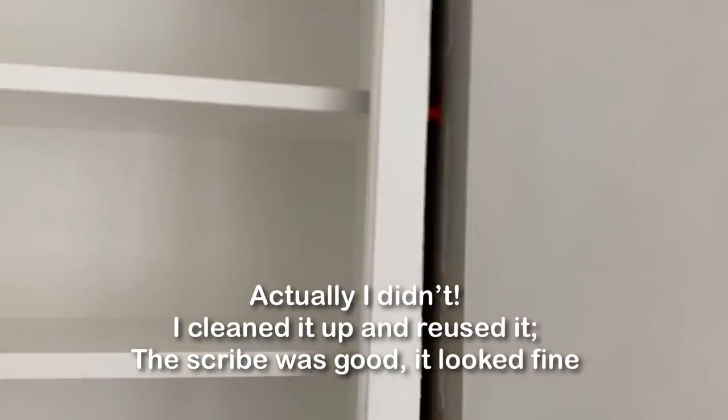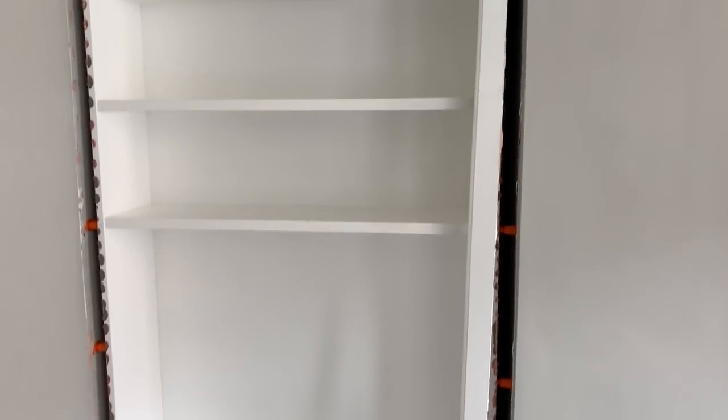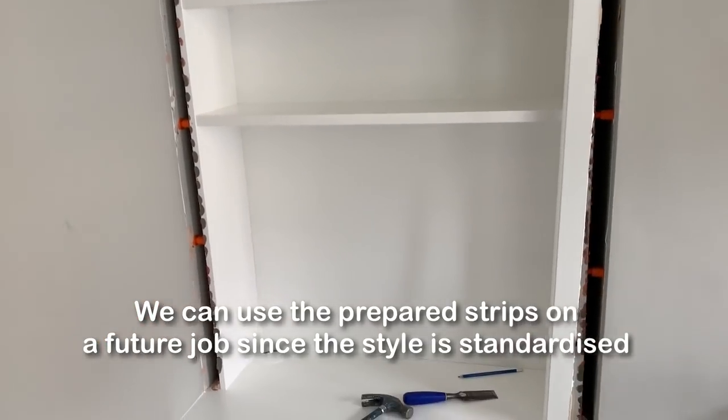Let it dry, two-part filled it, over-painted it. So if you looked really closely you could see the brush-painted join but with it being in shadow there it never jumped out at you. I'm going to replace that now because we have prepared another strip. So it's kind of a good opportunity to fully fix that. With the one over here I think I can probably put that one back on and glue in the very slight splits and over-paint them, so I'll just be able to use that pre-scribed piece.